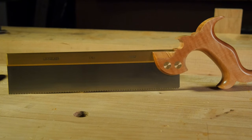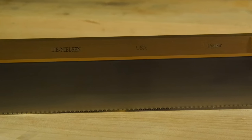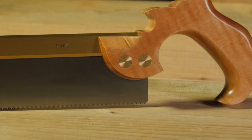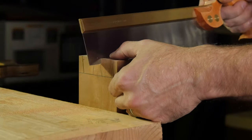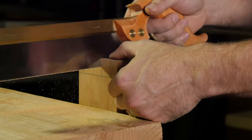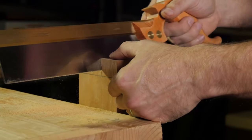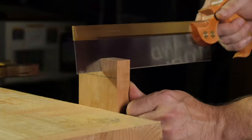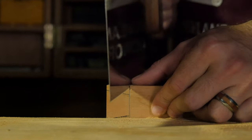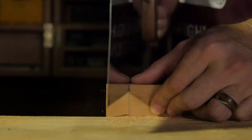Back saws are referred to by different names which ultimately refer to the size of the saw in both length and depth of plate, and those names do align with their general purpose, but that doesn't mean one can't do the job of another. From smallest to largest, these sizes are the dovetail, carcass, and tenon saws. Dovetail saws are the shortest length, the thinnest plate, and range from 14 to 18 points per inch. These make fine, narrow cuts and have a shallow and short plate for the small depth of cut required for dovetails. These are generally filed for rip cuts. However, there is one other relatively new tooth geometry referred to as hybrid, which performs both rip and cross cuts very well with minimal sacrifices to overall efficiency. A hybrid filed dovetail saw allows for enhanced performance on the cross cut on the half-pin shoulder while maintaining rip performance on the main cuts.